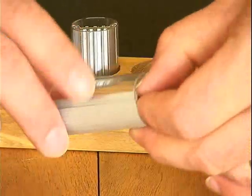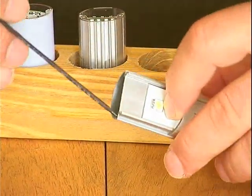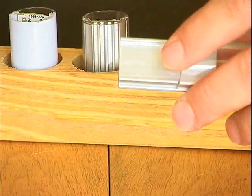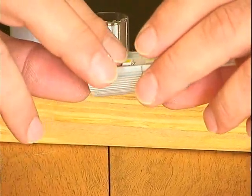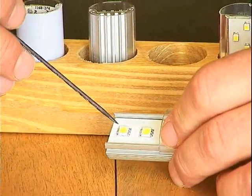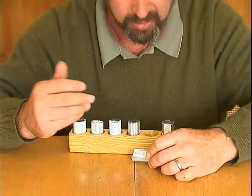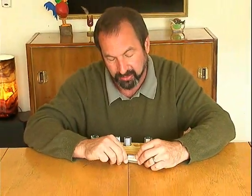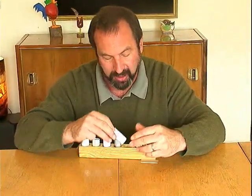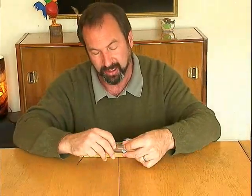Our third choice is, once again, very similar, has a full aluminum half shell, but the circuit card isn't bonded at all. It's just floating in there, so you don't have the intimate thermal contact. This uses a larger scale 5mm surface mount diode, which is a choice some manufacturers choose to go. Any surface mount diode is a reasonably good solution for a lighting grade product.